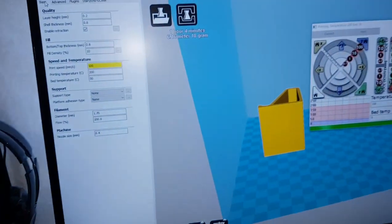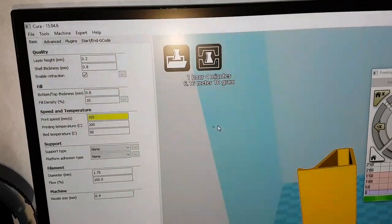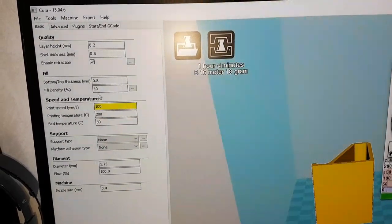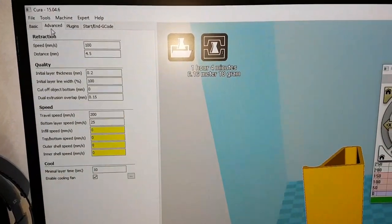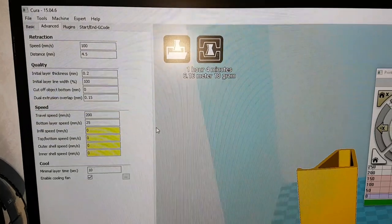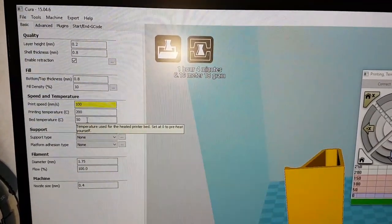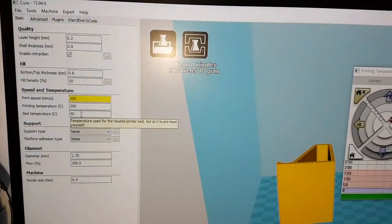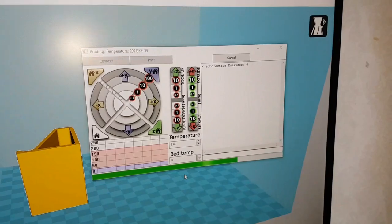The settings that I use, you can see here. So 1 hour print time, 10% infill, 100 speed and 200 travel speed. First layer was 25 only. So this is it. When I use 50 degrees on the bed for the first couple of layers, I shut down the heat here, so you don't need it after it. This is it.